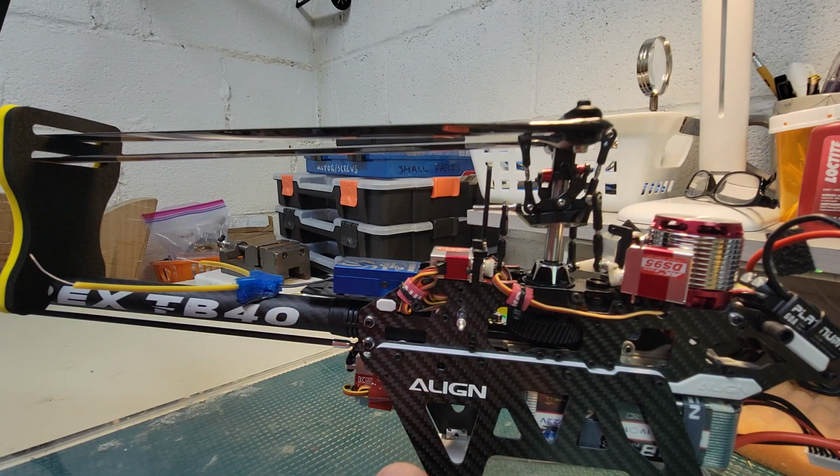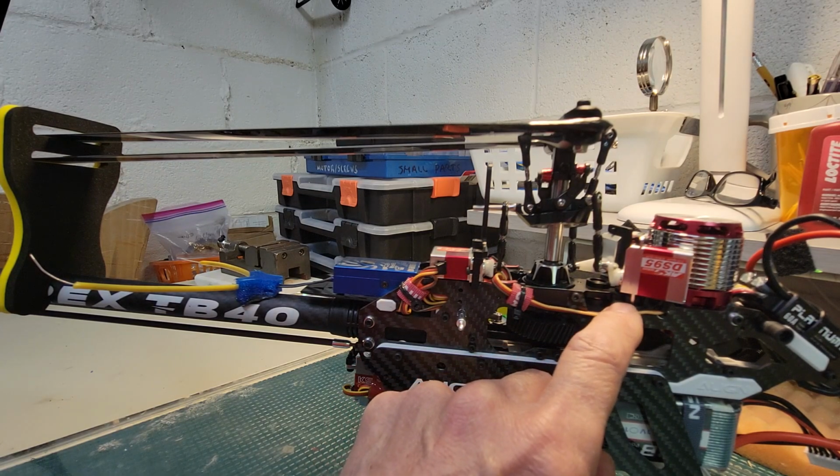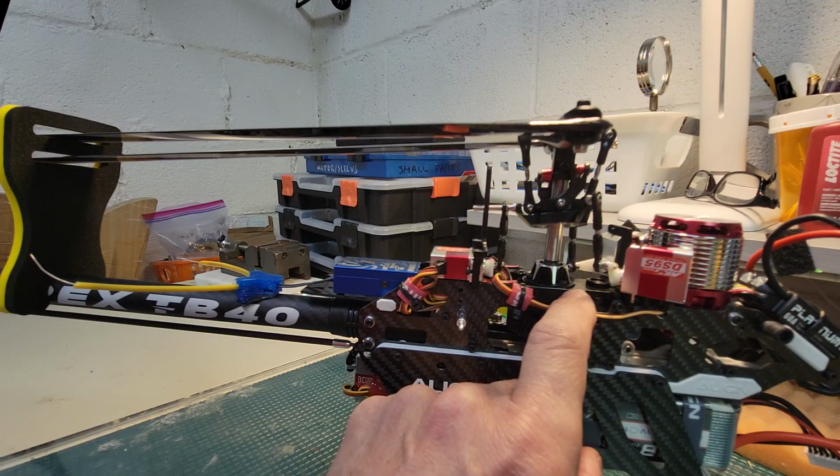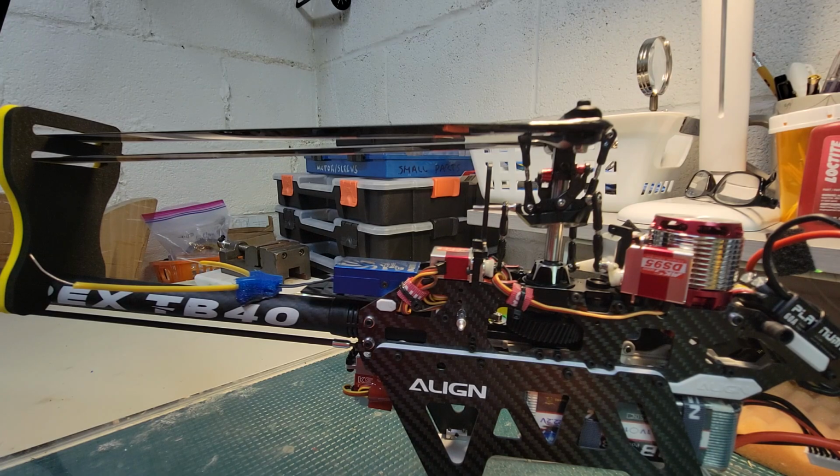And if you don't already know, when you use red Loctite, when it's time to take it off, it's good to heat up the metal with a heat gun or put a soldering iron onto it, touch it onto it till it gets hot, and apparently that allows you to pull red Loctite out, which is super important on small M2, M3 screws, because you could just snap them off inside. Then you lose an entire piece of CNC aluminum, which is very sad.